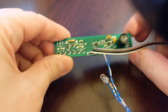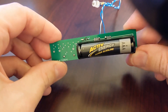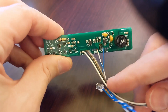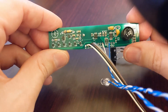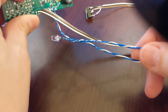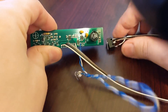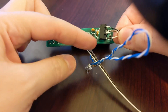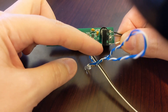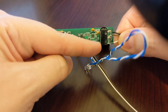And here's the final product — the board came out looking pretty good. On the back there's just the battery holder. I expect that one AAA battery will last quite a long time, but I haven't done any real testing yet to see how well this thing performs. The blue wires are going to my LED, and you can see the limiting resistor in series with the LED. The other wires go to the switch. This is going to be mounted with double-sided tape in a position where my cabinet will hold it shut when the door is closed. When the door is open, the LED turns on — the switch just acts as an on-off anytime the door is opened or closed.